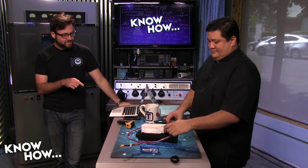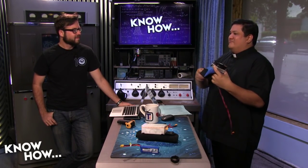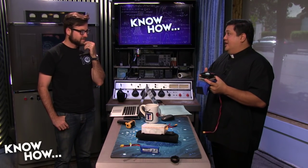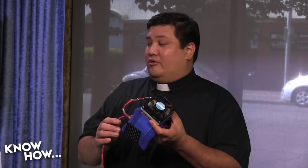If you had made it just a few millimeters taller, you could have inserted LEDs underneath the fan to also incorporate how much power is going to it. And that's one of those things where even if you don't think you're going to need it, go ahead and print yourself a fast prototype first. Because you will figure out things you want to change for the finished version before you use up all the filament. Because I printed this at 90% density, this adapter used something like 7 meters of filament. If I had printed the fast prototype, it would have used less than a meter. This probably took about four hours — if I'd lowered the density, it would have been about a 30-minute build, because the denser it goes, the slower the print has to move.